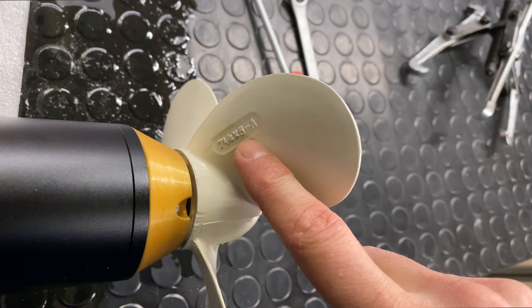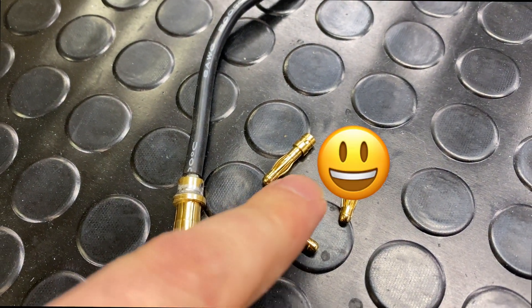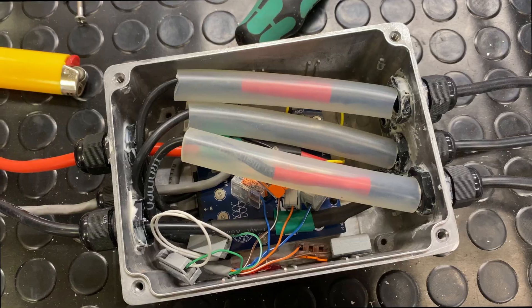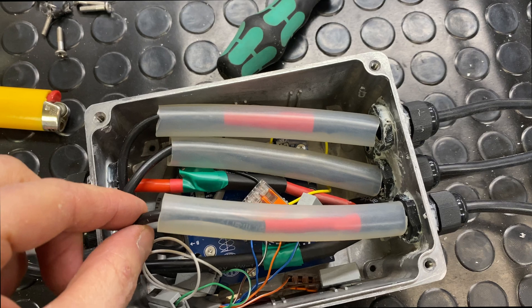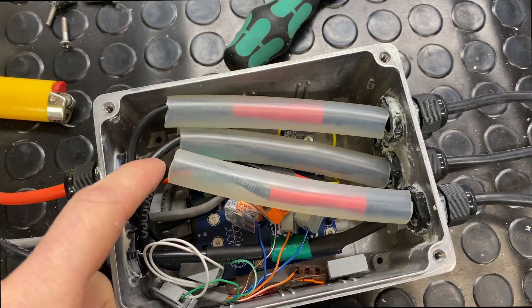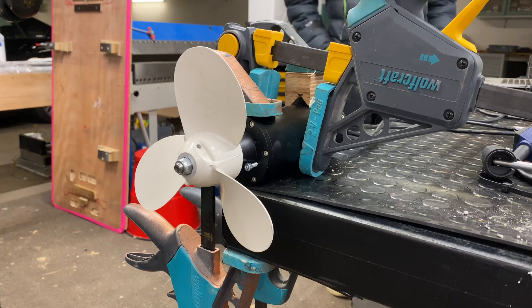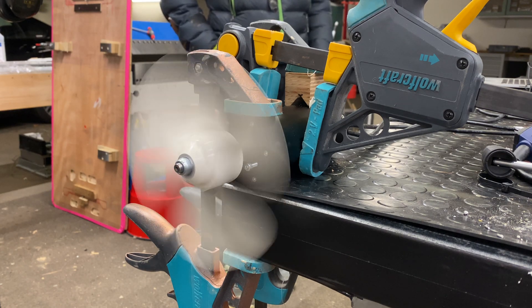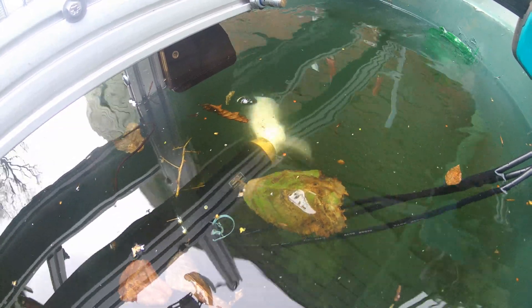These plugs are lovely but they're the same kind as on the vest and I don't want to mess with that, so I'm going to swap them out. With these big cables the hot air gun is the best option to get them off. I added silicone sleeves so in case these solder connections fail, the cable hopefully won't short to anything. I let the ESC do the setup — I had a fire extinguisher ready just in case anything shorts out. The ESC does some tests and figures out the right parameters for this prop. As you can see it spins up really nicely. I attach it with screws and added some oil so they don't seize in the water. Time for testing — just listen to these sounds; I think they speak for themselves.